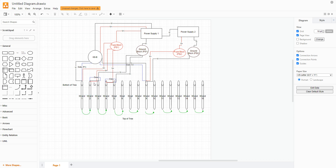Power flows in from the injection point and travels both directions along the strand — that's completely fine since it's the same power supply. Ground does the same thing. We loop at the end, bring in another power injection, send power both ways, and tie the grounds together so everything has an ample return path. This pattern continues all the way through strand eight, but I didn't draw all the connections to keep it manageable.